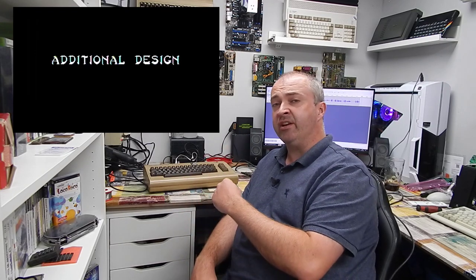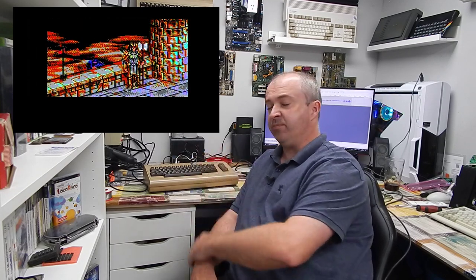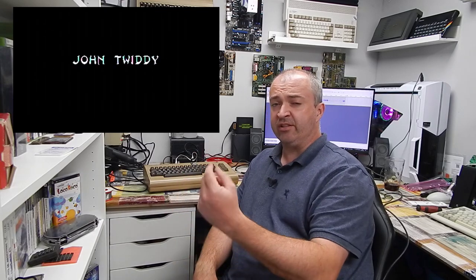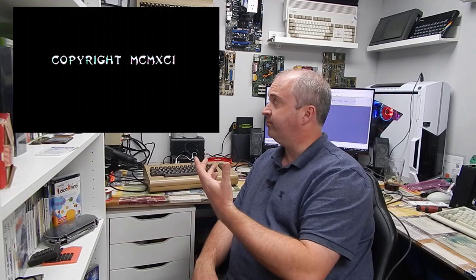Two faults in the end, the 74139 and that 4066. I suppose I'm just happy that all the customs in there were fine. That PLA and the SID chip, for example, I suppose especially that SID chip, those are getting quite expensive. So thanks again to Woz for letting me have this just for the couple of pound that he wanted. The only other thing that I want to do is give the case a bit of a clean, and then this one will go on the shelf and join my collection.